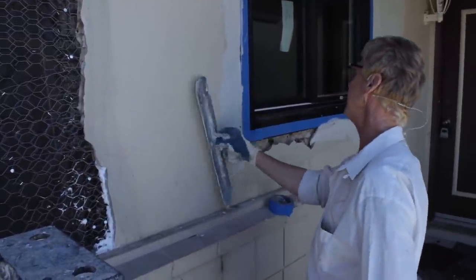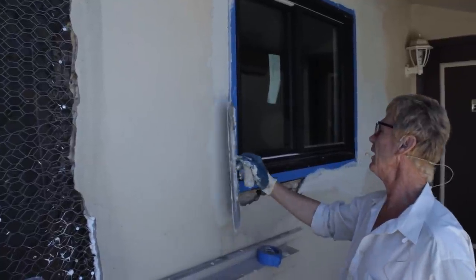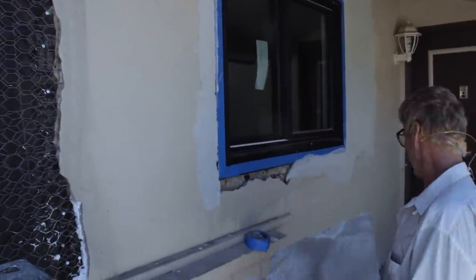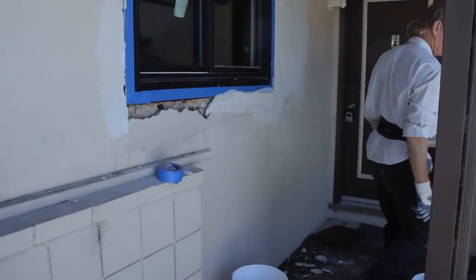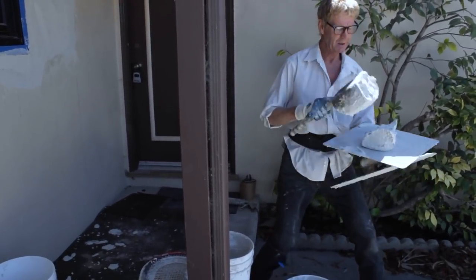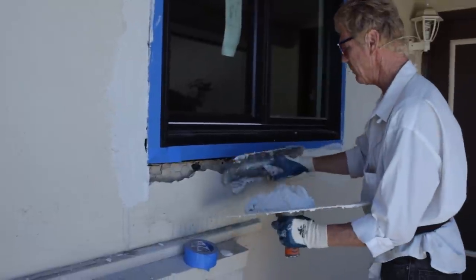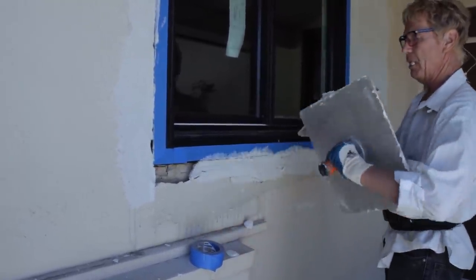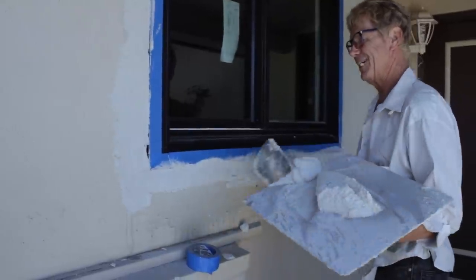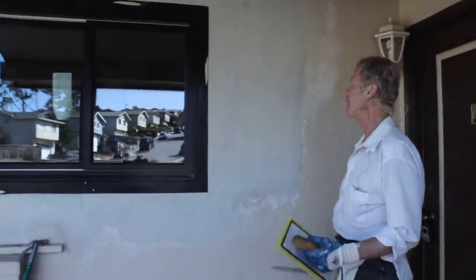Notice that windows are usually inset, so I'm taking it in right here a quarter inch. When I get to the top and it sets a little bit, I'll take all that in a quarter inch — because that's code, you want to have your flange on there. I'll finish this little piece here, then patch that next hole, and by the time Jay mixes me up more mud this should be ready to float.